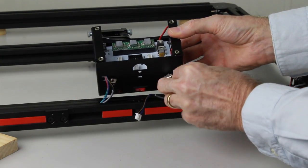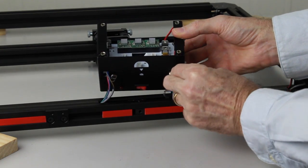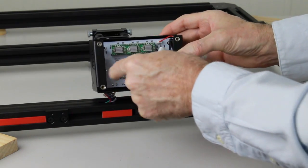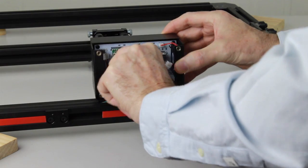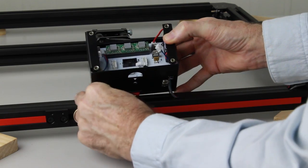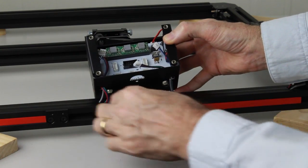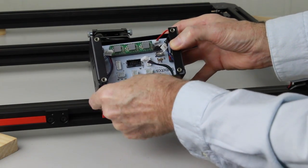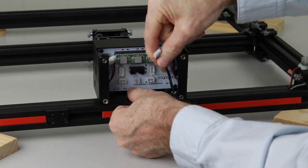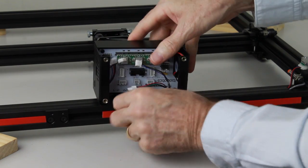Same on the other side. Motor cable, then the sensor cable. Once we've got those through, we just need to pull them up, make sure they're not getting caught on anything. Okay, so then we want to align the nuts so they're running in the same direction as the beam, and then we can slowly lower those down, pulling the cables to make sure they aren't getting jammed